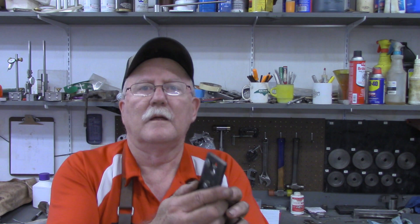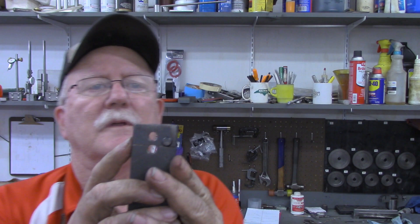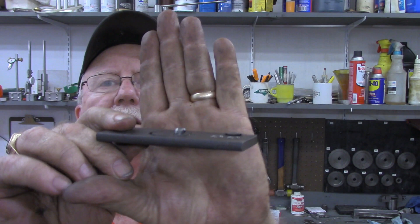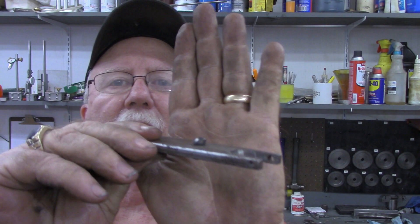Alright folks, it's obvious there's a whole lot about setting rivets that I don't know. I hope some of you will leave some comments. To recap quickly: this first one right here was put in just cold with no setting tools, simply peened over with a ball-peen hammer. The second one was put in cold using the setting tools we made on the lathe. Third one — our first attempt at hot — the rivet laid over to the side. Second hot rivet also laid over to the side.